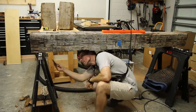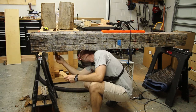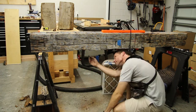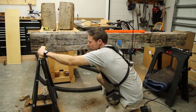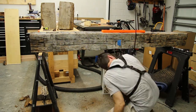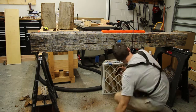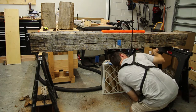One step at a time. After deciding which faces would be the front and the top, I marked and labeled them with some blue tape. With the horizontal beam upside down, I checked for level lengthwise and widthwise on what will ultimately be the top surface. I used some shims to make sure it was sitting true on the sawhorses. The surfaces were really irregular, so I took several readings and got it generally level across the whole piece.